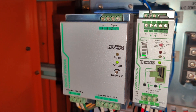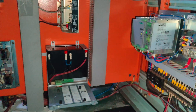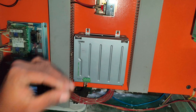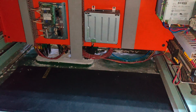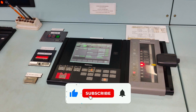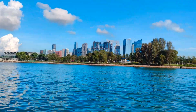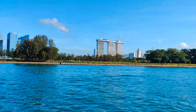The job of renewal of the batteries is to be performed with the main engine in stopped condition. So in order to maintain continuous and uninterrupted DC supply on your main engine remote control console, it's time to check the last renewal date of the UPS batteries. If you find this video informative, do hit the like button and share it among your colleagues to be a better engineer on board your vessel. Don't forget to subscribe to my channel for such informative knowledge related to ME engines. Thank you for watching. Wish you all safe seas and a healthy stay on board.